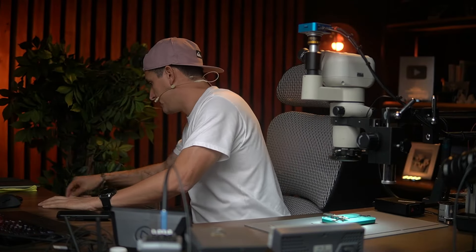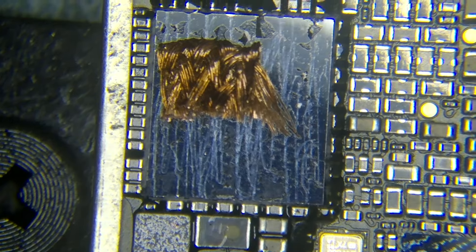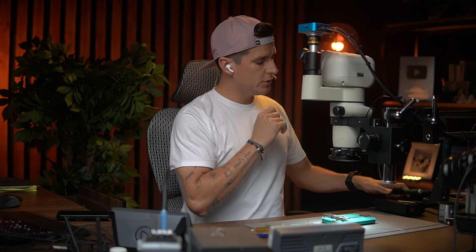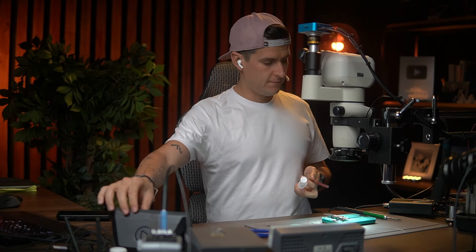When you have it like that, I'm going to bring some wick, flux, and some solder wire. I'm going to use this kind of iron — this is a T15 iron, I think it's 70 watts. I like to use this one because it's a powerful iron so you won't have any problems. I'm going to use 450 or 400, and I'm going to apply some flux.